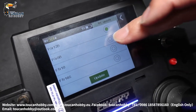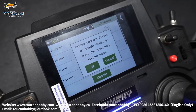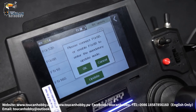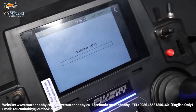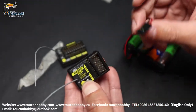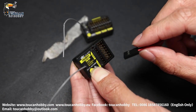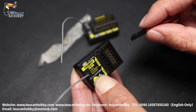So now it is FGR-8B — choose 8B and update. Please connect FGR-8B and enable it to enter mandatory update mode. So for updating to match with the radio, you have to press the bind button and then power on, hold for more than 10 seconds. You'll see the quick flashing red light change to slow flashing — then it is okay.